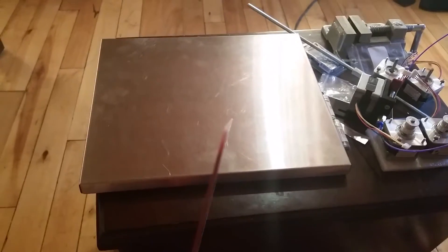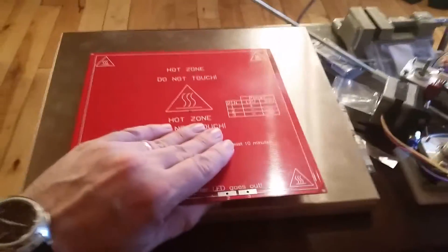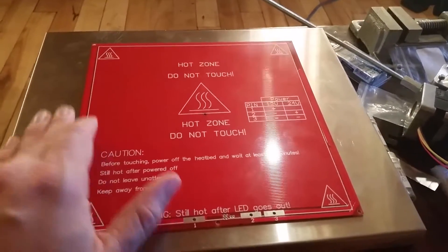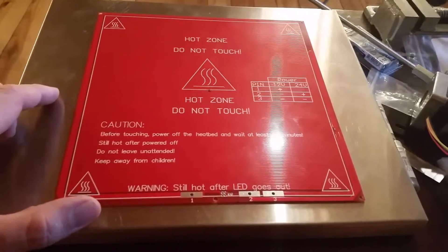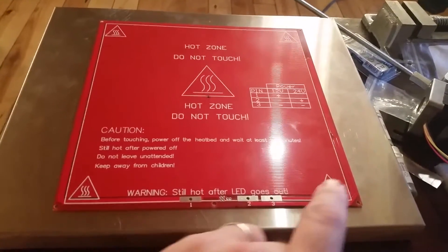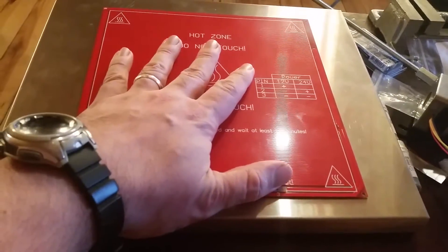The corners were quite high. You'll see there's still a tiny bit of a curve in the edges — just a tiny bit. It might be partly from how I'm holding it. But when I got it, it was quite pronounced. Right now it's sitting nice and smoothly on this stainless steel plate. But when I got it, there would have been about two to three millimeters from the surface to the edge here, all the way around. So it was quite bowed up in the middle. Right now there's no movement — it's perfectly flat to the steel plate.